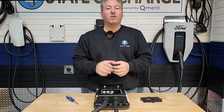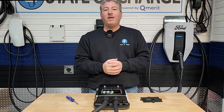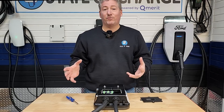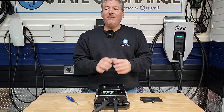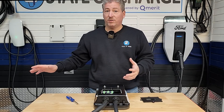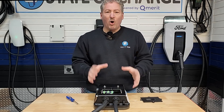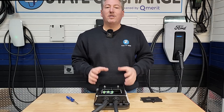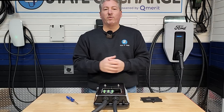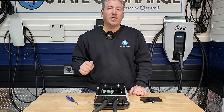Qmerit has a network of licensed electricians that specialize in installing EV charging equipment. Any electrician can pull a permit and do this, and many will do a fine job — but not all. EV charging is different from any other electrical appliance in your house: it pulls more current than the rest of your house while charging, and you ask it to do that sometimes every day for many continuous hours. Hard wiring reduces possible failure points — you're not going to be plugging and unplugging it. Get yourself a portable charger if you want something in your trunk for the road. Hard wiring is much better.